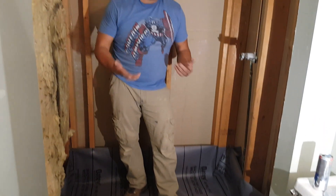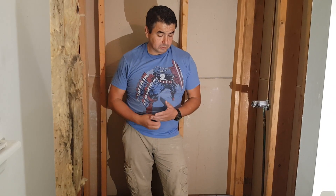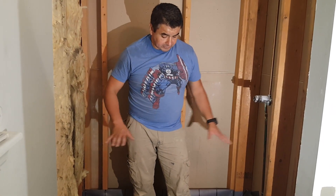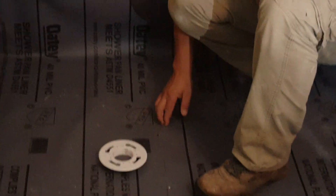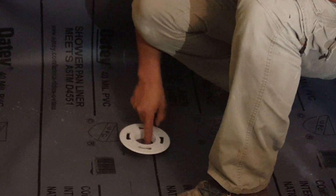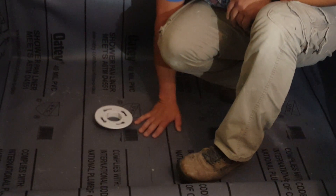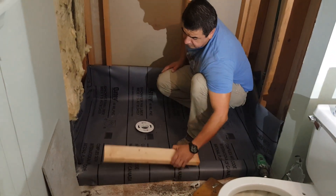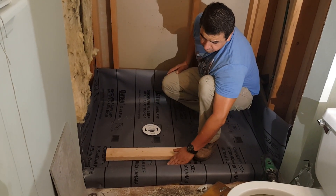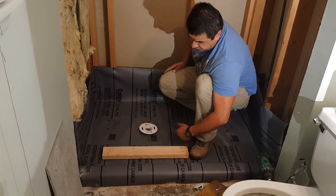Now that we have the shower liner in, let me tell you some important things about it. The shower liner is designed to contain the water inside your shower area, so you don't want to cut the edges or corners where you're going to do the folding. You want to fold it like when you're wrapping a gift — fold the areas and hide them away from the studs if possible. The reason is you want to avoid bulkiness so you don't end up with concave walls that will look weird at the end. Don't cut those corners.